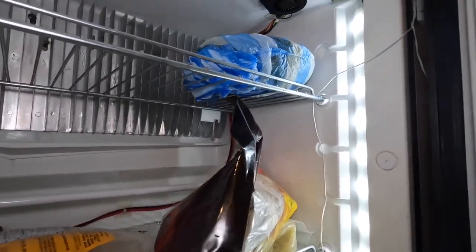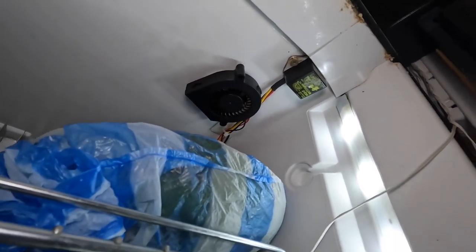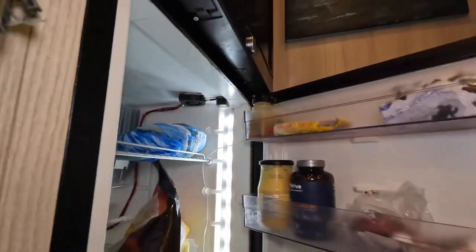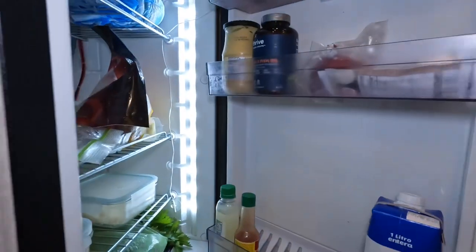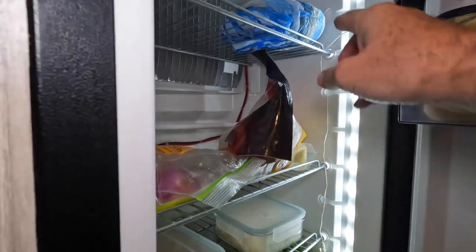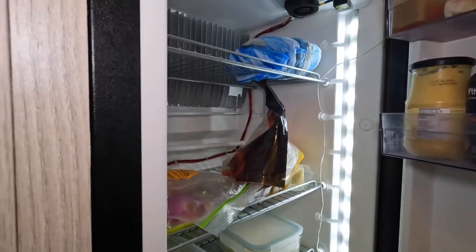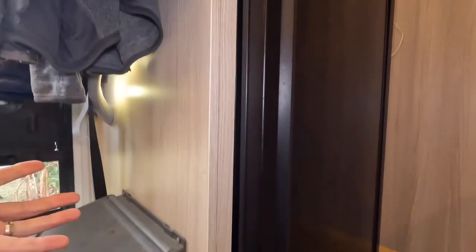The other thing that I've done is, this is an aftermarket product, and I'll put it in the description down below. It is a 12-volt light sensor, and what I don't want to happen is when I open this and it's super hot, I don't want those fans to continue to operate and blow cold air out. It's just too hard to regenerate that cold air. I want them to turn off immediately. So this sensor senses these lights, and when it does, it opens the circuit and shuts the fans off. And then the minute I close this, the lights go off, and if the system's running, the fans will start again.